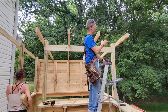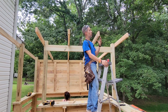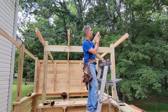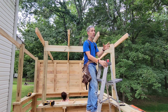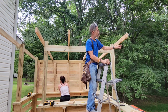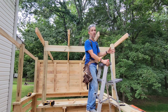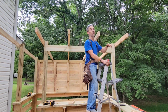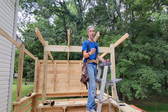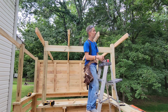Okay, team, so here's what's going on with this. These rafters, I tried to get as much out of them as I can, but even where I got them cut at 95.5 inches, once I cap it with 3/4 and 3/4, that's gonna be longer than 8 foot. The metal we got is only at 8 foot. So what I'm having to do is cut these things back this much right here, which is really like 1 5/16 inches, but I'm gonna be adding back on 3/4 inch out to the front and 3/4 out to the back. That's gonna bring us right at 95 3/4. So you're gonna have like an eighth of metal showing at the front and an eighth in the back. That's the way I planned that. So that's what we're gonna do.